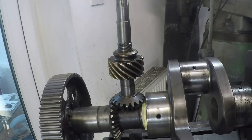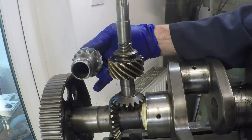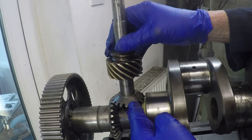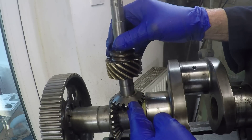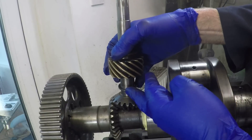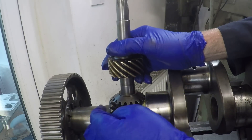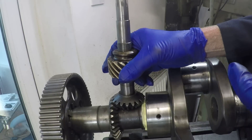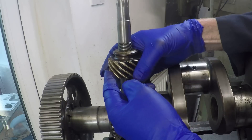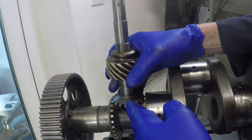One of the first things they discovered was a correlation between the backlash in the pair of bevel gears and the backlash in the skew gears. What I mean by backlash is play in the gears. You don't want these two bevels meshing really tightly — you need to have a certain amount of play — and this is achieved by washers on each shaft which go underneath the bearing. This enables you to set each gear in very specific positions. What they found was that if the backlash on the bevel gears was greater than on the skew gear set, it was causing damage to the skew gear.